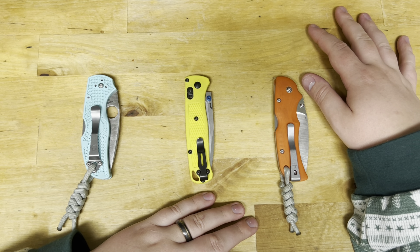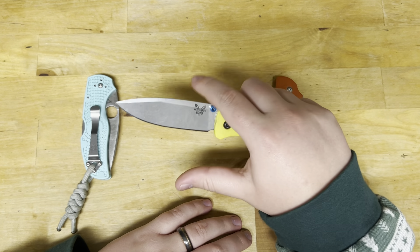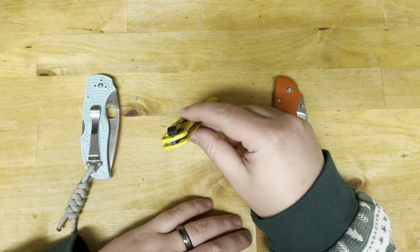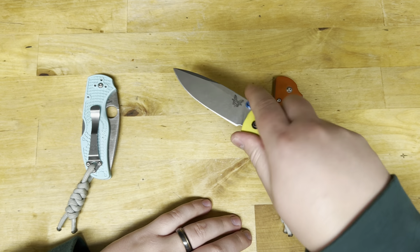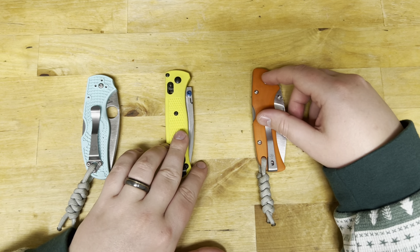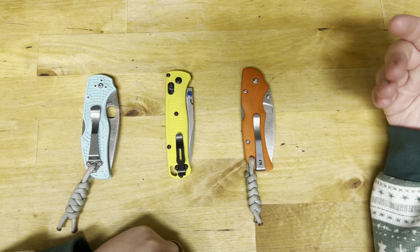It's definitely only for a knife — meaning a cutting tool. I scraped with S90V, and that's fine — scraping is a form of cutting, you're using the edge. It's not a prying or batoning kind of steel. If you're doing straightforward cutting tasks and need to cut for a long time continuously without worrying about your knife, S90V is going to do the job for you.